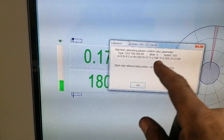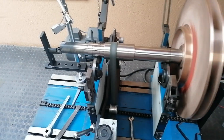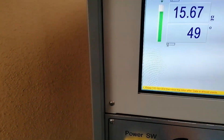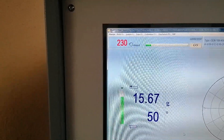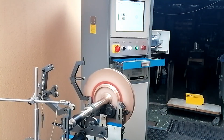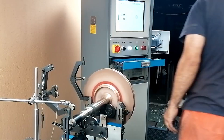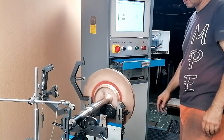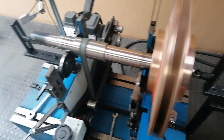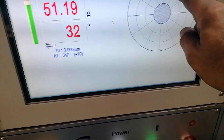Okay, so she's ready to be calibrated. I press OK now and we'll start the machine. She's on the machine and now running at 228, so I can start cranking up a little bit. Alright, there she's running — she's at balance speed. She's 51 grams out at 32 degrees, so she's not actually too bad.